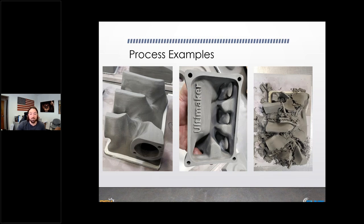Here's another failure example — a beautiful manifold with multiple inlets and outlets. It did have a live setter underneath, but gravity wins again: there's a lot of weight on the shoulders at the top, and the inside was hollow. As you remove the plastic and wax and reach the temperature where metal begins to tack together, the part becomes increasingly fragile. Unsupported areas like this need support structures in place. This is a great example of why working with experienced people in the industry early on makes a difference.